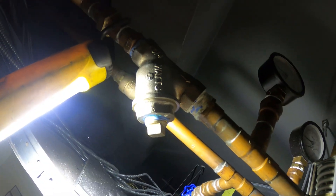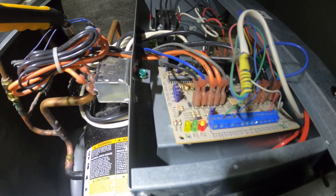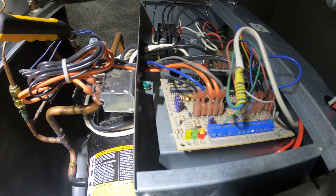Here's a strainer and I'm definitely curious about that. To restart this unit we're going to have to kill power — that's what's going to reset it. So let's do that and watch the pressures and see what happens, see if this even starts.